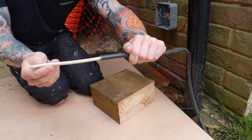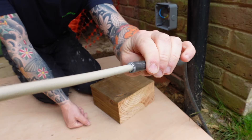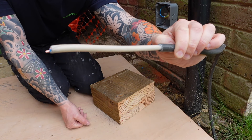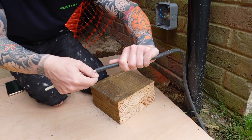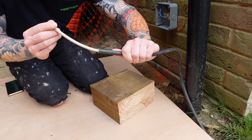Pick a few cables at a time — don't try to do them all at once. Unwind them and work them away from the centre conductors, moving them back and forth, and they will snap off. Do that all the way around the cable until you have no more steel wires remaining. Once done, you'll be left with your centre conductors inside the inner sheath. Before moving to the next step, make sure you haven't gone too far with the saw and damaged any of the conductors inside.